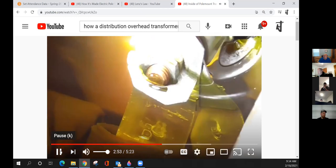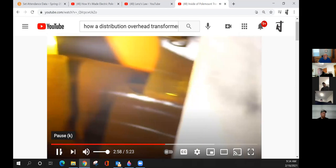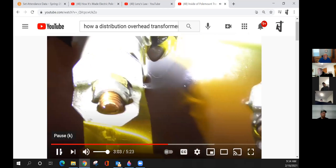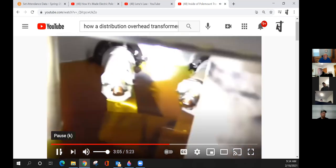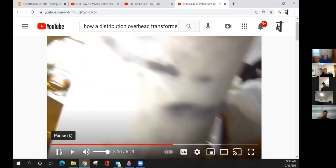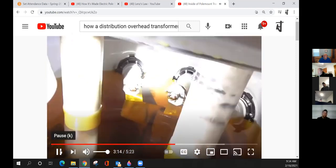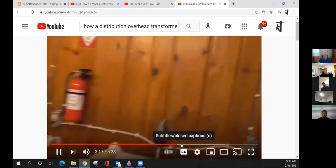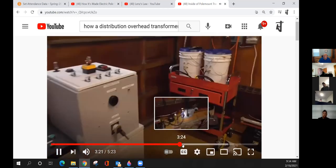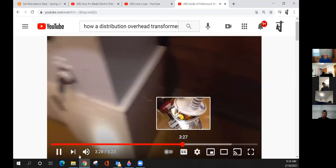That's a center tap to join two 120 volt coils that are out of phase with each other. And then there's terminal D, which is your other 120 volt leg. So with both of those legs, you'll get 240 volts. And then with one of these legs to neutral, you would get 120 volts. And you'd use 240 volts to power your dryer, your stoves, your ovens. I use that power to power my experiments, which comes up from the basement. And yeah, that's pretty much it.